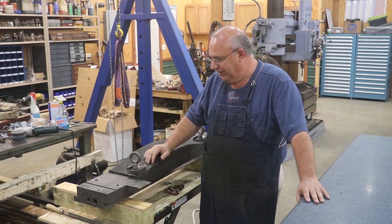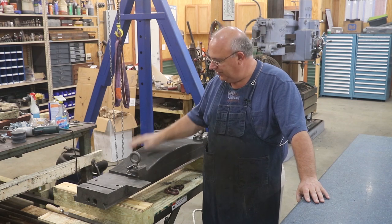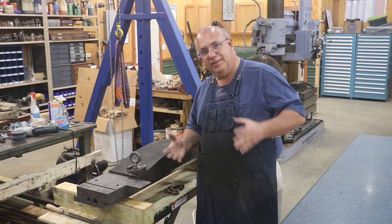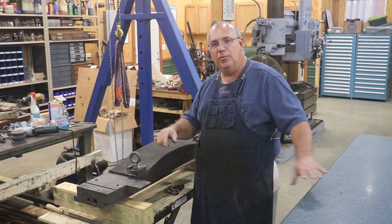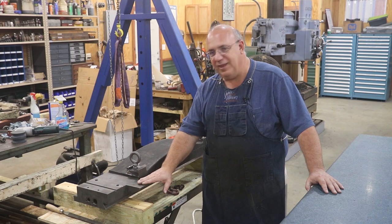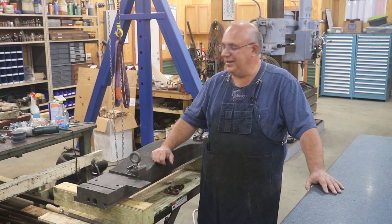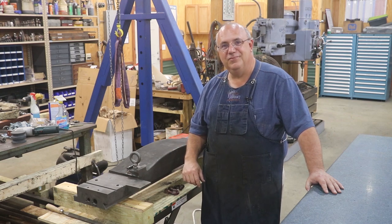Well guys, I think we're going to call this a wrap for now. We've got the two front ends on the same plane. I've been doing some thinking — I'm going to change my strategy a little bit, and we're going to take that up in the next video on how we're going to go about getting these sides parallel with one another. But we've made a lot of progress — the bottom here I think is really probably good enough, I got good coverage all the way across, it's nice and flat. We'll be continuing this scraping episode in another upcoming episode. As always guys, thanks for watching — please leave comments and subscribe to the channel. Follow us along on the restoration of this late 1800s vintage metal planer. We'll catch you on the next video.